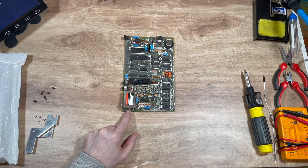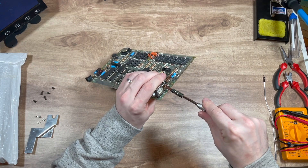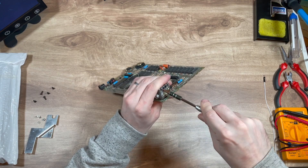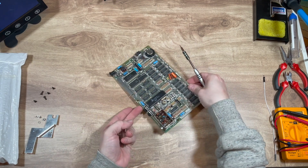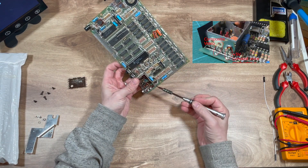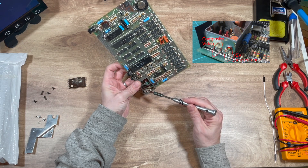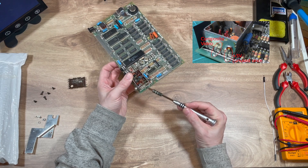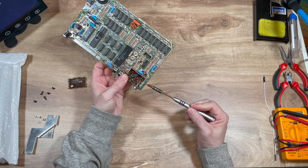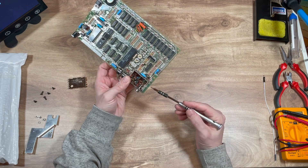So this is the side we need to be — we need to lift the top off. And there we go. So basically we need to snip this: we've got 5 volts going in, snip that resistor there so it has nothing to go to, take that one out, and then go from that hole there and solder to there — and then that is the composite out. But obviously this needs to be disabled, so that will take the 5 volt away.